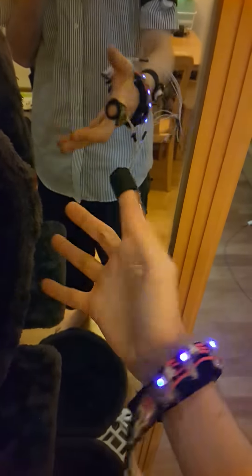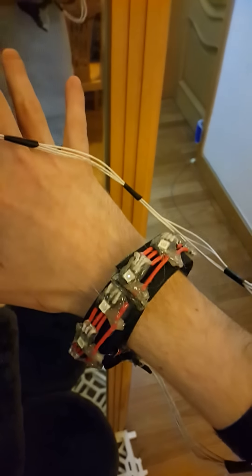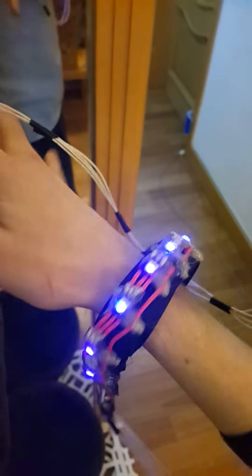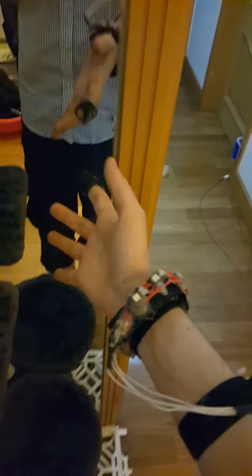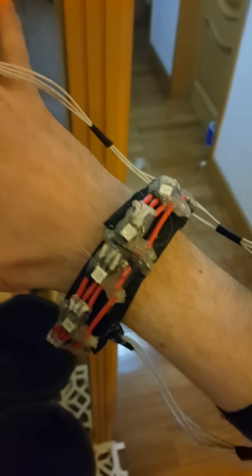Long story short, there's a vacation here in China so I can't get parts until it's over, and I'm stuck with what I have on hand. I don't have any LED strips, so I had to hand-make one. I don't have any legged RGB LEDs, so I had to use these SMDs I had lying around — hand-solder them to little wires, connect those to bigger wires, and build a relatively sturdy bracelet. That's why the high-gauge wire; obviously you don't normally need that kind of wire to run that many LEDs.